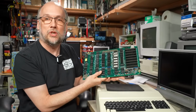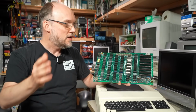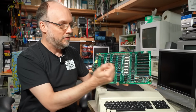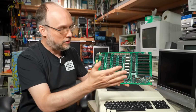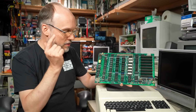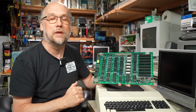There'll be a link in the description, because as usual, this is a continuation from part 1 where we left off. In that part, we found some faults with this motherboard. The first was a dead video section that made the whole computer look totally dead, and that was caused by a bad transistor which had shorted, so I found that and replaced it. But then the computer still wasn't doing anything, and it turned out that there was a bad transistor in the reset circuit, keeping that from working as well.